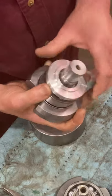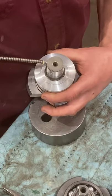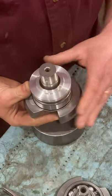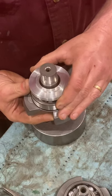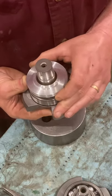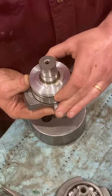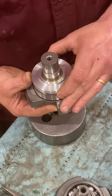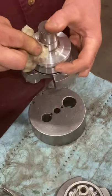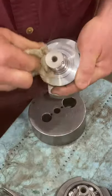It's just sitting on top of that collar. I put more oil in, and then what I'm doing here is letting gravity do its job and letting the oil fill the grooves inside the labyrinth seal. I help it along by turning and moving it a little bit, and eventually all that oil I put in there is inside that seal.